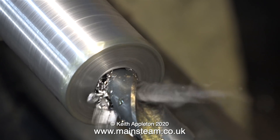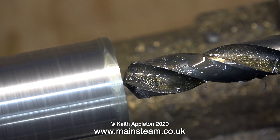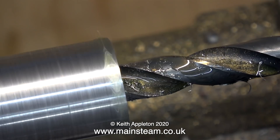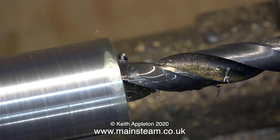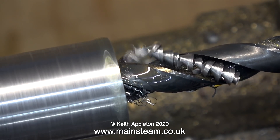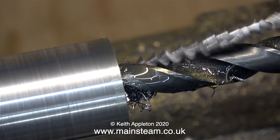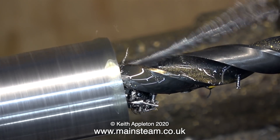In this clip I'm drilling the first hole through the centre and this is half an inch in diameter. The twist drill is held in my tailstock chuck and you will notice it is thoroughly covered in oil. A lot of heat is being generated by the tip of the drill bit, and also as the rest of the drill bit goes through the hole, so it's always a good idea to apply as much lubrication as you can.